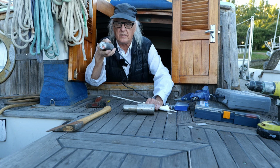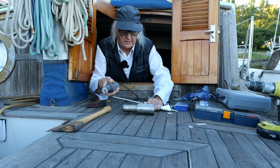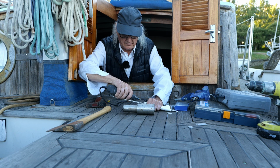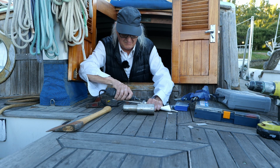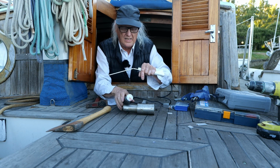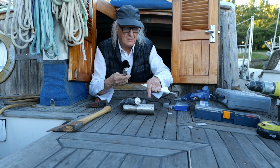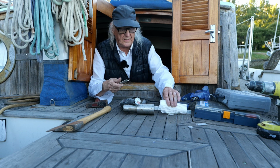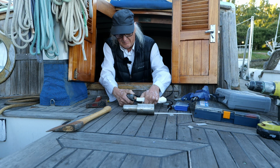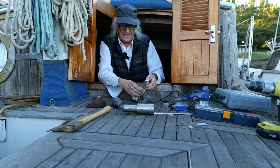This time, instead of cutting through on one end and then cutting all the way across, I'm just going to go back and forth across the top, and just slowly go in. That way I won't get kickback like I was getting. Okay, so it's good enough. Now I can just break it the rest of the way by bending it. Okay, now I just got to grind it down a little bit. It's pretty hot. Yeah, this thing's hot. Ouch.